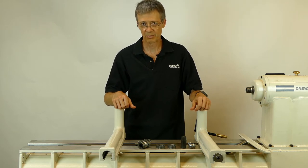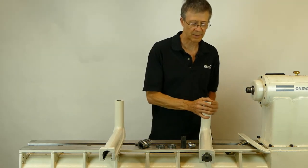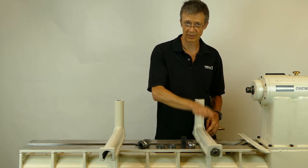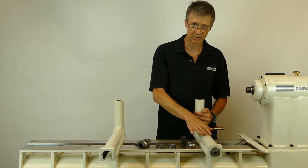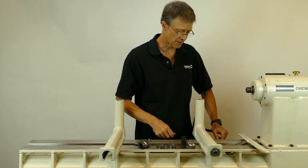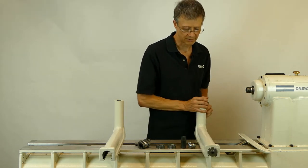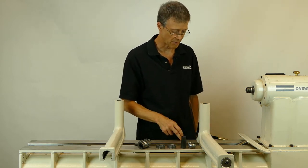In our banjo we've got patented technology that nobody else has. All other lathes, the shaft that clamps the banjo has got a cam machined on both ends. The cam raises and lowers an eye bolt, and that is what clamps the banjo to the bed of the machine. With a longer shaft, you can get considerable deflection. So when you're clamping in the middle of the range, you push down on the handle, the handle will deflect a long way. When you clamp close to the ends, the shaft is supported, and you won't get nearly the same amount of deflection.